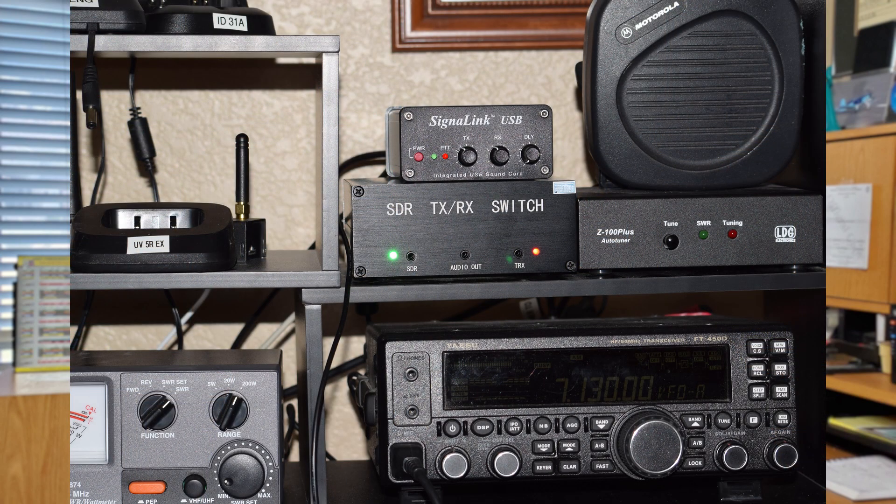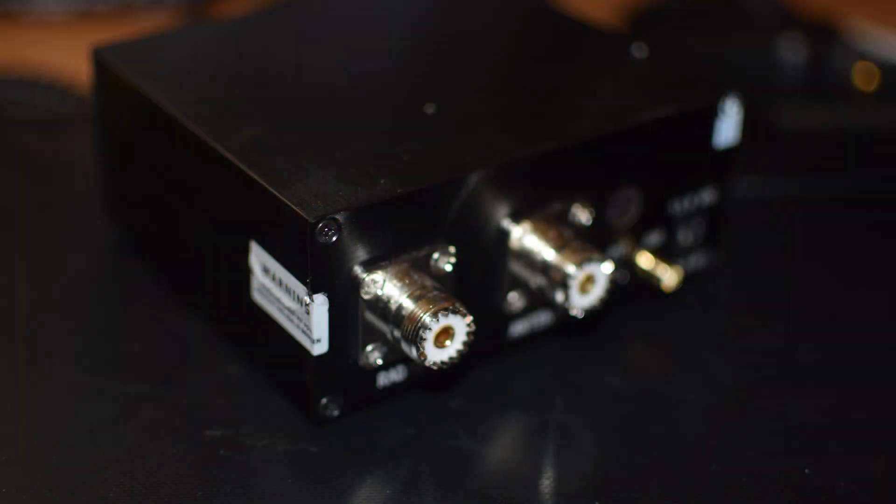By changing from Mode 1 to Mode 2, my transceiver's receiver was again active and WSJTX worked like a champ. As you can see in the photo, when not transmitting, both LEDs are lit. A one-page instruction on a seller's site would certainly have made this easier to figure out, especially when the jumper was hidden in the box and behind silver warranty tape.